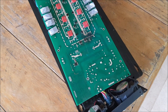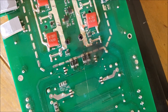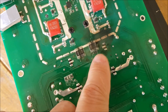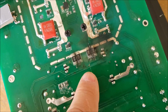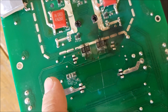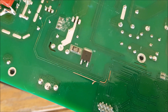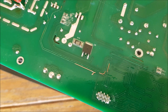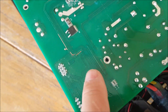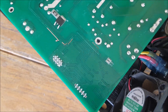This is the 2000-watt inverter, and as you can already see, we have extensive burn areas. This is probably a broken transistor. All these current sensing resistors here are completely burned, and not just that — if you look at these sensing resistors, there are very small traces for metering, and you can see that even the solder mask actually peeled off. That means the trace got really hot and was destroyed.